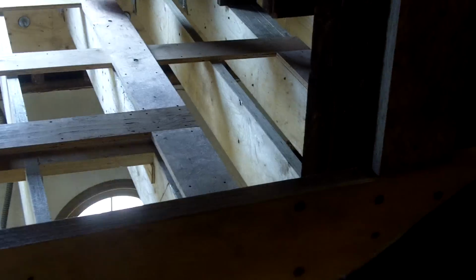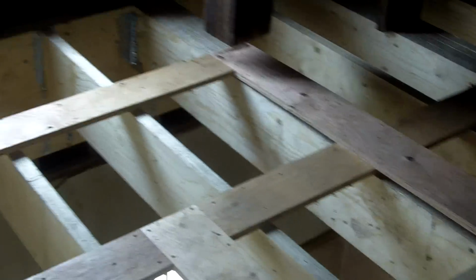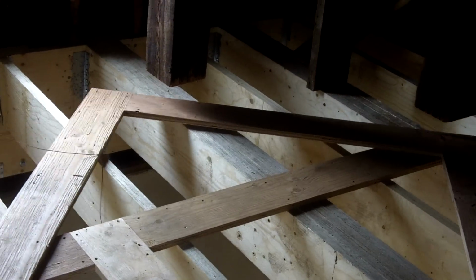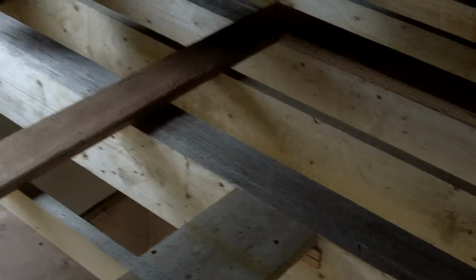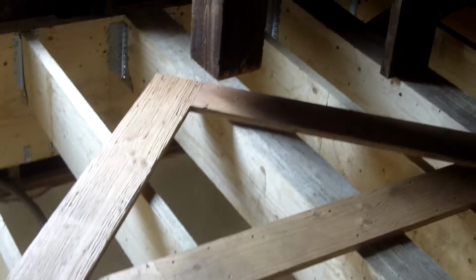At some point, I'll be back to show you the beams will be replaced. I'm going to just slide my template, just try to give you a better idea of how the template works. There's 2 rectangles that are identical placed on top of each other, and from the dead center they are slid. There it is now. And when the corners all measure the identical measurement, I know that I have a perfect octagon at that point.